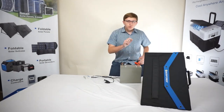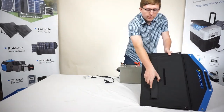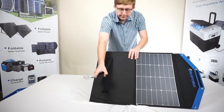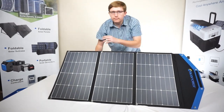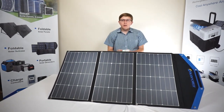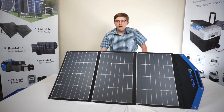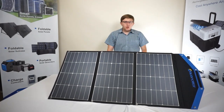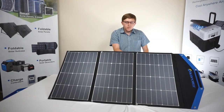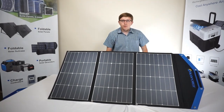The next step would be to unfold your solar panel using the included legs on the back to adjust as needed into the sunlight. The charge indicator on the charge controller will display if the connection was successful and the battery has been charged. At this point, if the charge controller displays a low voltage error but a good battery voltage has been tested with a voltmeter, it may be possible that the steps discussed here were not executed correctly.